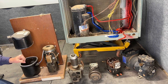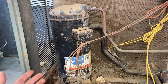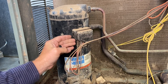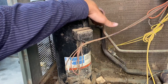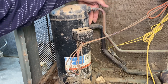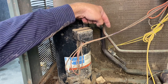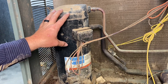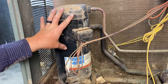I like to start the refrigeration cycle with the compressor — the compressor is what's doing the work. Here we have our power wires coming into the side of the compressor, and there's a motor that's pumping the refrigerant. Here we have our blue line, which is our low-temperature, low-pressure vapor coming into the compressor on the suction line. And here's our discharge line coming out — refrigerant is flowing out this way in red, and coming into the compressor this way as blue. It's simply a vapor pump: sucks low-pressure vapor, pumps high-pressure vapor, moves the refrigerant.